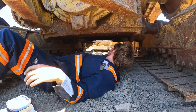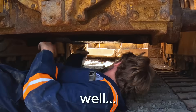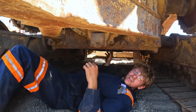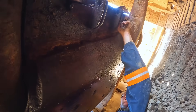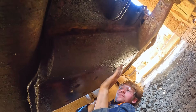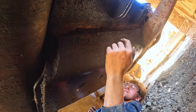I'm going to take the jack, jack it up and undo what appears to be only two bolts holding this belly pan on, and then hopefully find the leak so the customer knows what's wrong with it. I was wrong — there's one bolt here. There are supposed to be two bolts that hold this down so that the belly pan can hinge, so you don't have to take the whole thing off when you're doing a service. They are obviously gone.